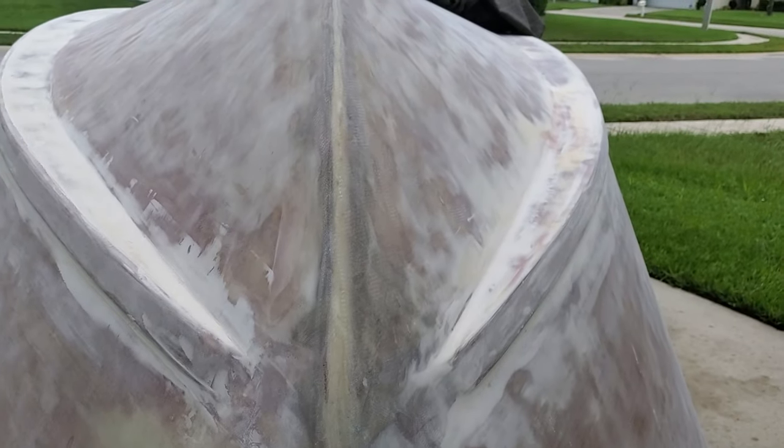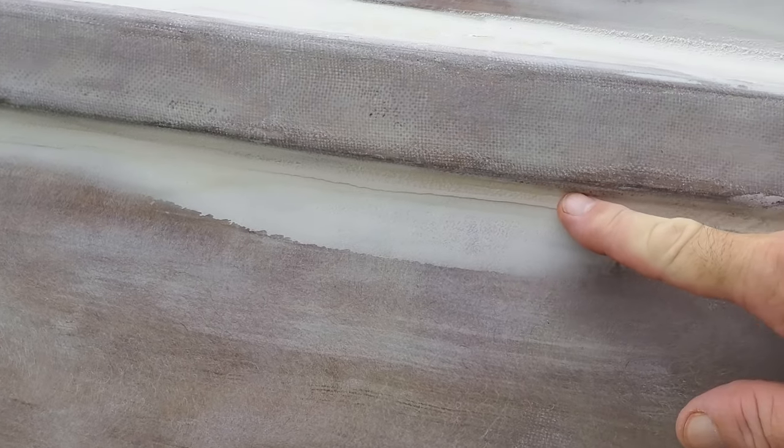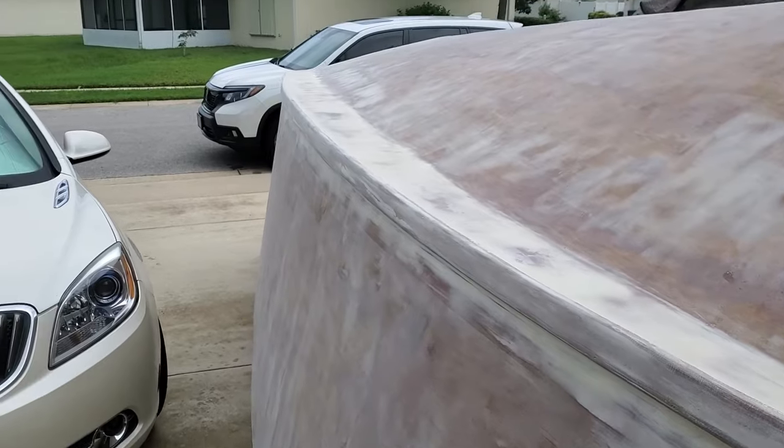It does look symmetrical and I'm quite happy with it — it came out well. But there was a lot of work involved, especially putting the fillet in. I have a nice round fillet, though that still needs to be sanded. I've got two layers of six-ounce fiberglass cloth on there to protect the wood. The wood, as you remember, is two layers of quarter-inch Meranti ply — that's what I used.